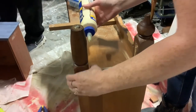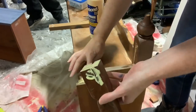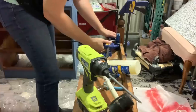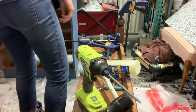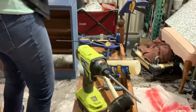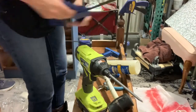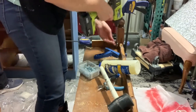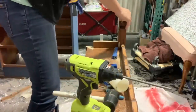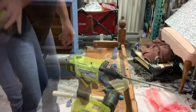This is a really easy way to attach things and it is incredibly strong. For these I'm using Titebond II. I don't need anything super crazy in dry time or strength because they also have the screws. These get about four pocket holes each. I have them connecting at the top around the skirt and also adding pocket holes to the legs themselves, drilling and putting the screws down into the base of the cabinet. So these things are not coming off. Every one of these cabinets is different — I've done several with different kinds of legs, all the things. Every one comes out awesome.